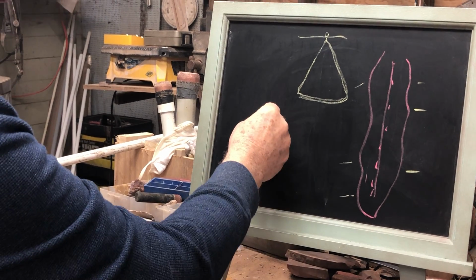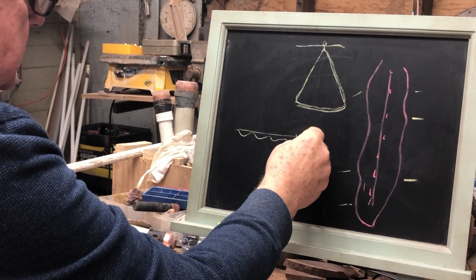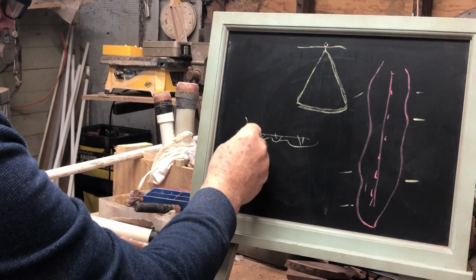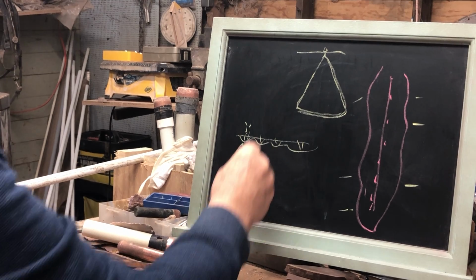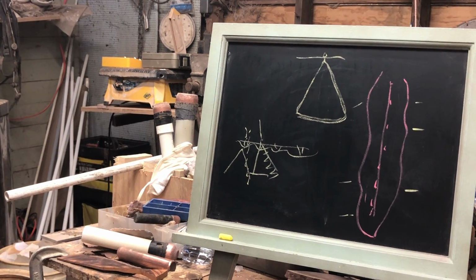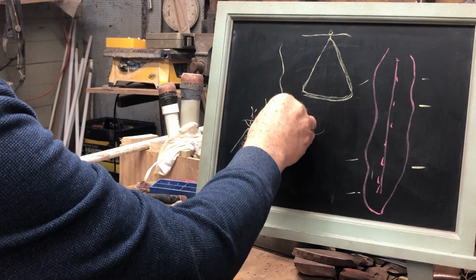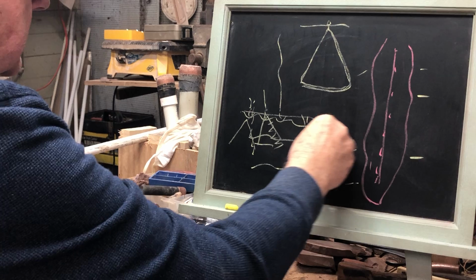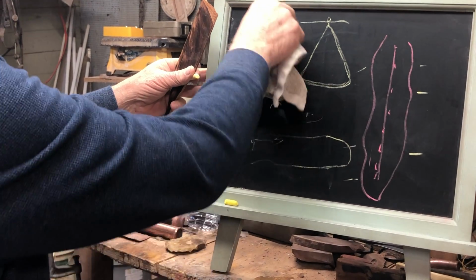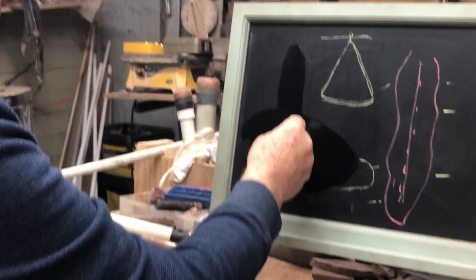So if you're sitting here and you got an edge like this, and it's wavy like this, this is a natural center line, and this is below it. All of these are below it right here. And you strike with that BB right here, straight down. This is all the material that's going to remove, right there. If you strike with that BB on this angle, it's going to come like this, and you're going to remove this much more material. You're going to thin it that much more. So the way I look at it is like this. I take this right here, and I've got me an edge. Let's run it this way, like this. And I strike, and say it's rounded here. I'm going to wipe this off real quick and redo it up here. I'm trying to figure out how I illustrated it in the video that the phone hit us on, okay? We're going to do it like this.